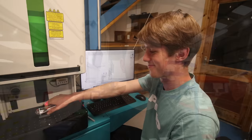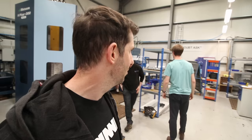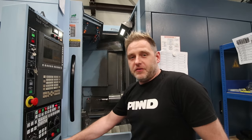Now showing how the cranks are made — back into the heart of the facility with the massive machines. They've got some new ones too, and this is where the cranks are made. This is a pretty fancy new machine — a 4-axis horizontal machine with 15 pallets on it. The advantage is you can do multiple cranks at the same time.